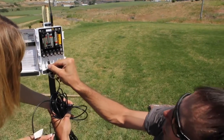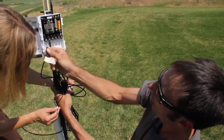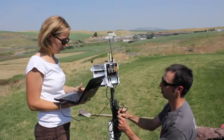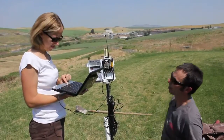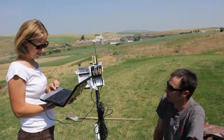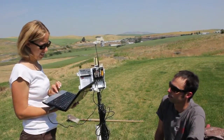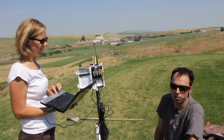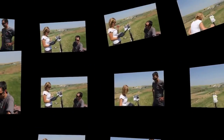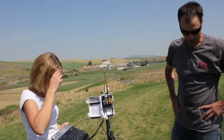Make sure you give yourself enough cable slack so there's not too much tension going to the logger itself. Our GS3 is going into port two and our EC5 is going into port one. Last but not least, you definitely want to check the logger and the sensors at the site — double check that your logger is configured and your sensors are both functioning in the soil before you leave.